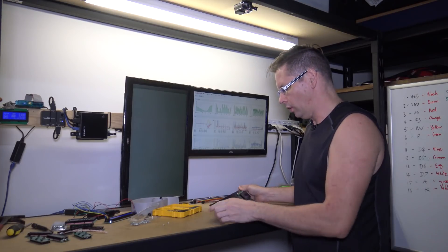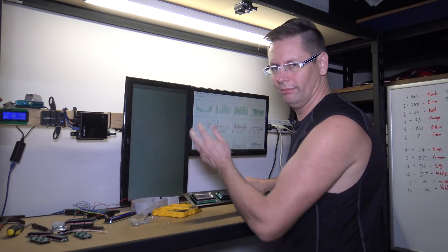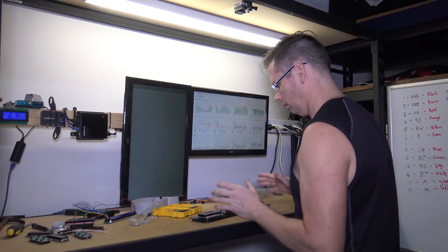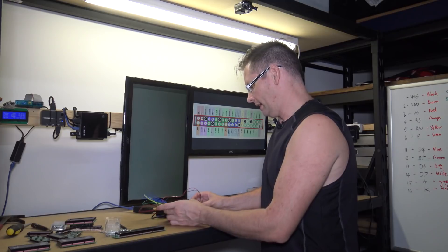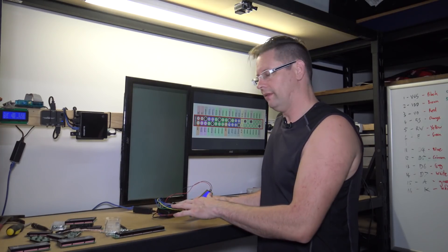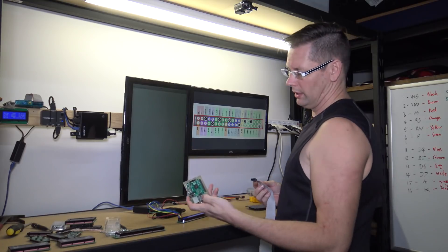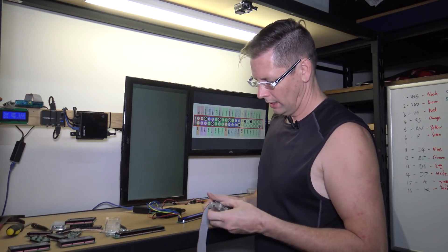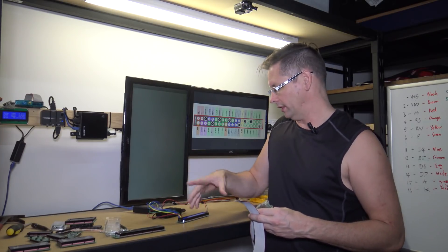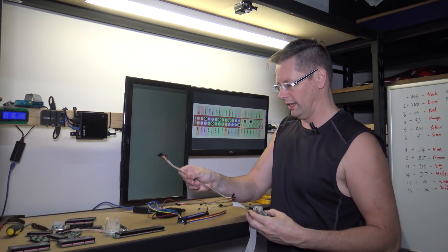Later on, once I finish the wiring, I'm going to drill holes in the middle so the wires can go through from the front to the back - that doesn't have to be anywhere near as accurate, just roughly in the middle. Now I'll look into the wiring. For the actual displays, some cables are common like the 5 volts and ground - those will be the same for all displays. The seven data lines have to have unique GPIO pins, so 21 in total. I've got the Raspberry Pi here with a ribbon cable, and for power I'll just split them off to the three different displays.